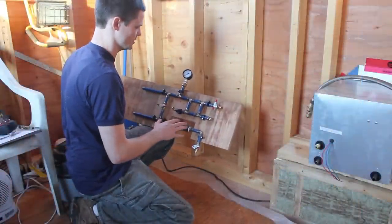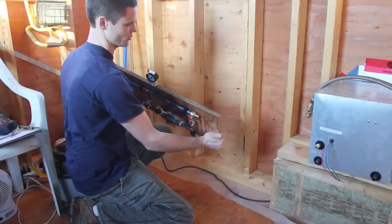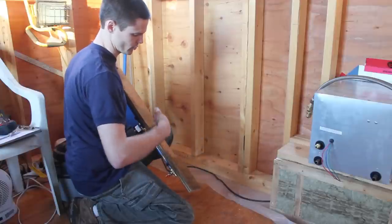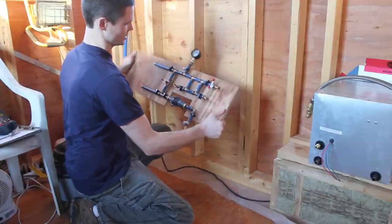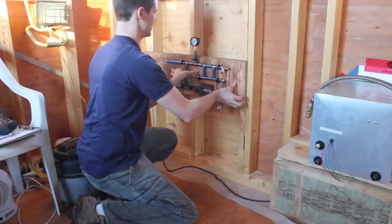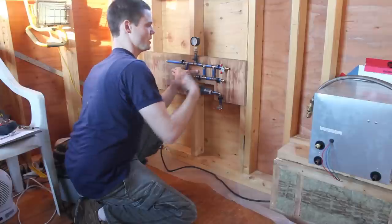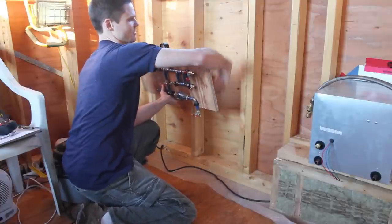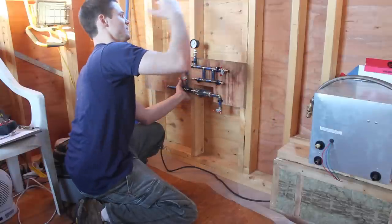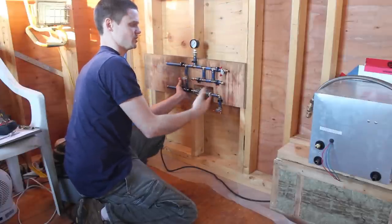I finished assembling the whole intake and distribution system. To make sure it'll always be accessible and easy to work with, I took a piece of leftover three-quarter inch plywood, which is thick enough to drive in these clips all the way without the nails poking through the back — so it's basically a completely standalone unit. I've cut the piece to length so I can just screw it to the studs for now, finish off the plumbing, and then unscrew it when we go to insulate, get the vapor barrier up, and put it back on. When the house is all finished it will be inside the kitchen cabinetry and always accessible for service and general operation.